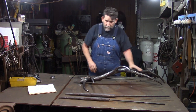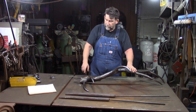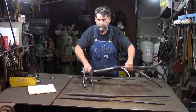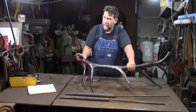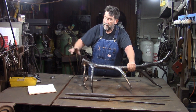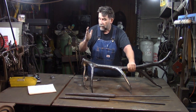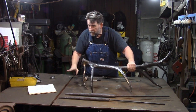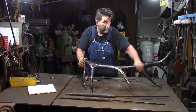we measure our full length again. We come down to our, I believe it was 43 inches. We come down here. At this point, we've got about that much more sticking out, and we've got a piece of pipe hooked onto it to handle it with. At this point, we cut that off, and we don't really want to cut it off straight. We want to kind of cut it from this way and from this way and give it a little bit of curvature.